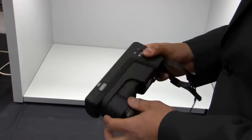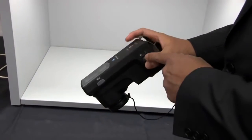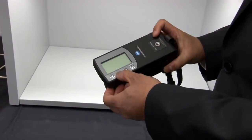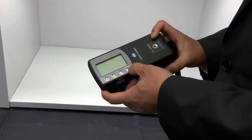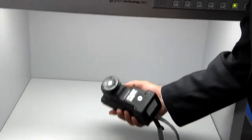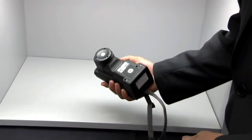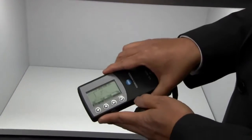Now that I've given you an overview of the meter, let's go take a couple of measurements. Here's the CL-500A — it's very simple and not intimidating at all. There are only a few controls on the unit: the on/off switch, the measure button, the up/down controls for the screen, the back key, the menu key, and the return key. To take a measurement, all you need to do is point the cosine corrected receptor head at the light source, hit the measure button, and you'll get a return of the reading.